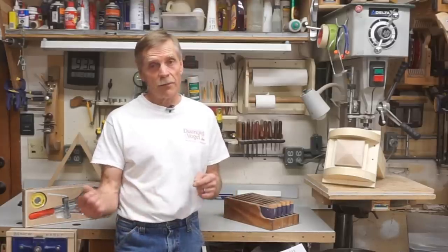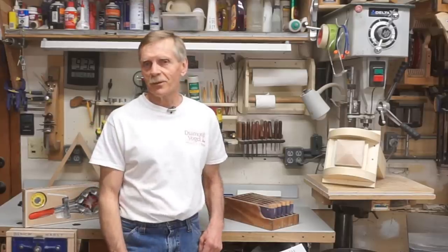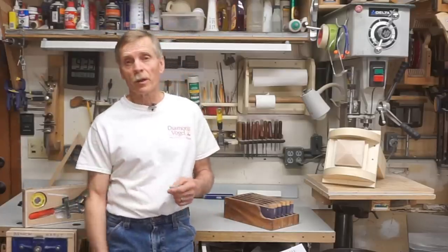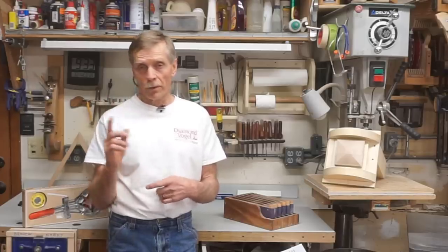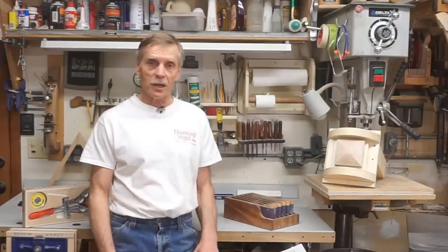For full disclosure, I want to say I wrote the script for this installation before I shot the video. In hindsight, I realized I should have said 'really rigid' instead of 'rock rigid,' because as you saw, the posts can flex and they vibrate even if they don't wobble. They are wooden newel posts, after all, and not steel pipes filled with concrete set in pavement for traffic bollards — those are rock rigid. So using that term here is a bit misleading, and I apologize. I am convinced, though, that this is as solid an installation as can be achieved for this post design and installation conditions, and that's pretty similar to other residential installations. A post with a smaller footprint would tend to flex more, while a big chunky newel with an 8- or 10-inch base would be a lot closer to rock rigid.